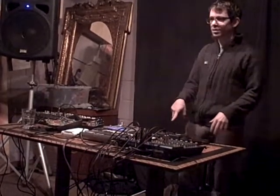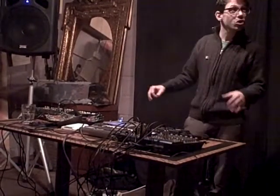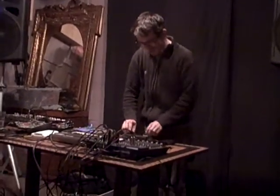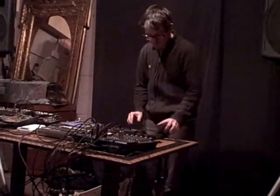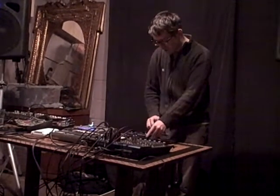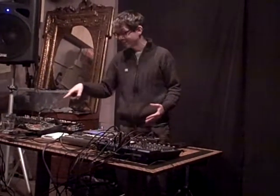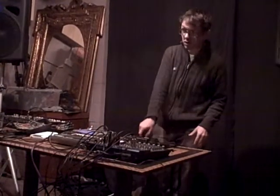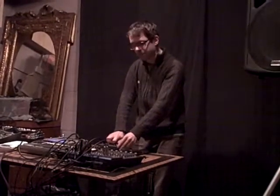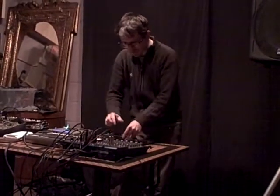With this one, I also built in an internal feedback, so the output goes straight back into the input, which gives, oh yeah, stuff like this. It's just the basic old feedback that you can then again, through building the LTC 1799 in there, pitch, so you can use it for theremin-like things. And it produces a lot.